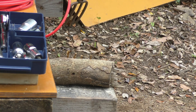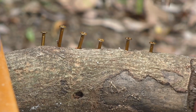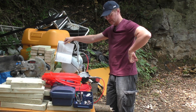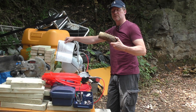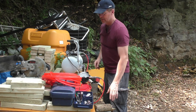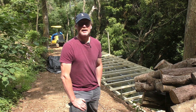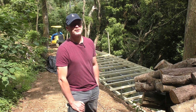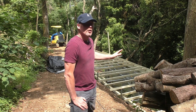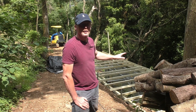The nails are not going in even when adjusted fully. The air compressor is not sufficient to drive the gun — it only goes up to 0.8. Well, I didn't get as much done as I wanted today, a little bit here and there, but small steps and we're still making progress. I've got some equipment challenges to sort. I've actually learned a lot about my equipment this weekend whether I wanted to or not: my nail gun is now working, my air compressor needs to be upgraded, and I've got all the rest of the framing lumber cut and prepared and stacked for the working platform, the deck.